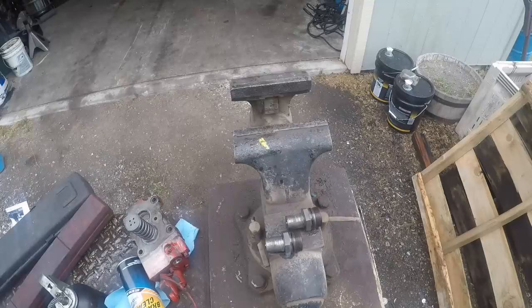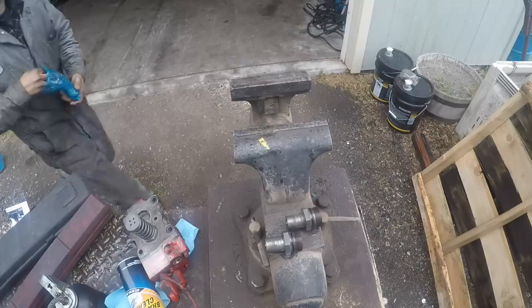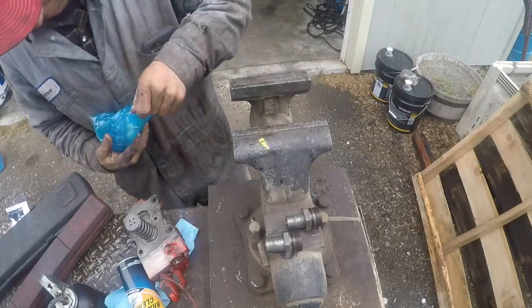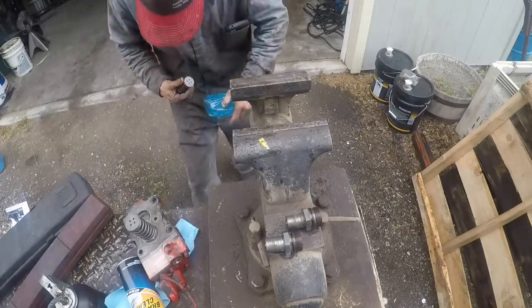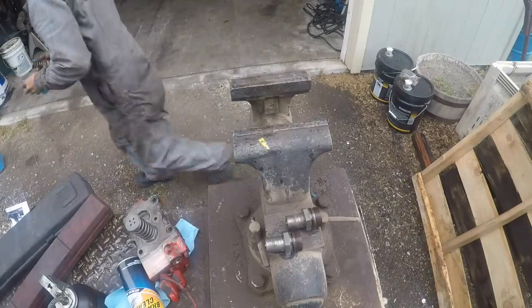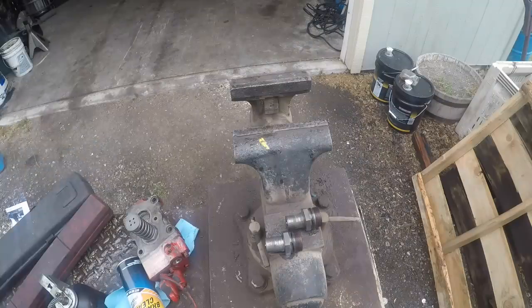So I went and looked at it, fired it up, and it was knocking. I said, yeah, it's screwed up. Haul it to the shop. So I did a relative compression test on it with my Texa diagnostic scan tool, and it came back with cylinders 2 and 3 low on compression. 2 was at about 60%, and 3 was like 15 or 20%, something like that. 3 was really bad.